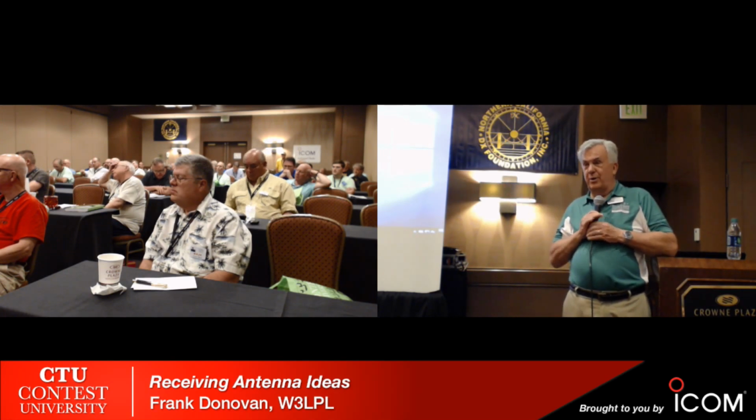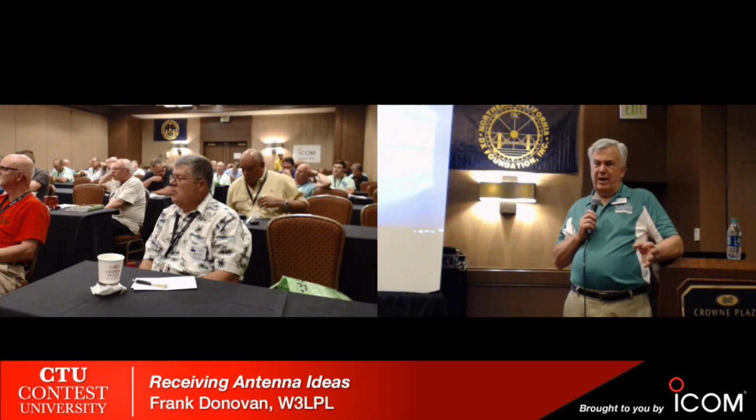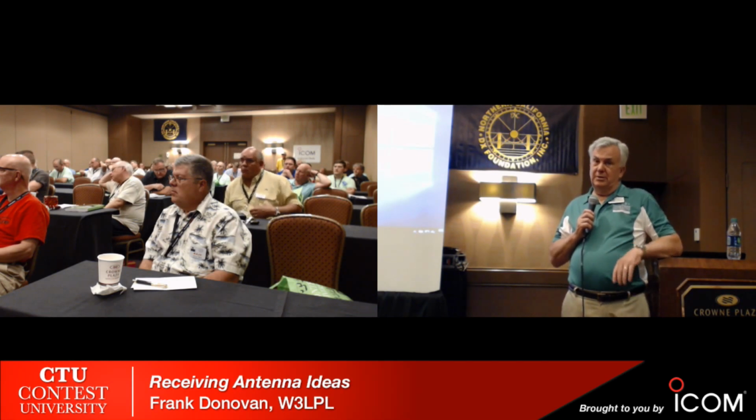You don't have to deal with coax and all of that kind of thing. It's a little bit of compromise to the end-fed, but not very much, because most of the radiation from a half-wavelength wire is from the middle, not from the ends. So that's my own opinion.